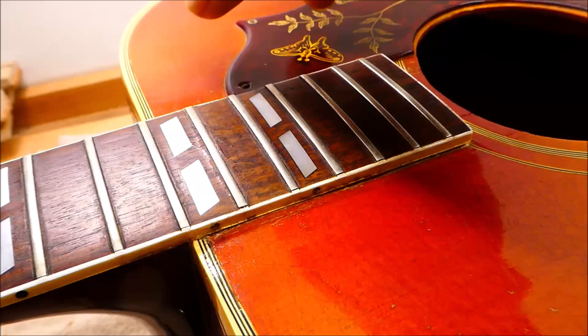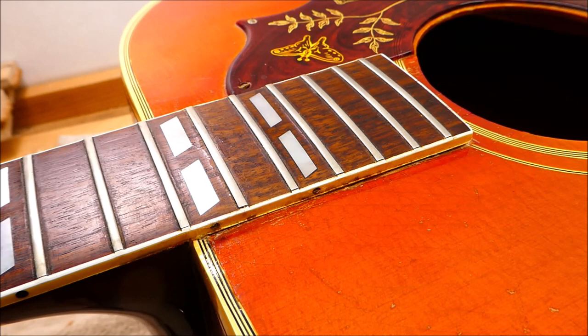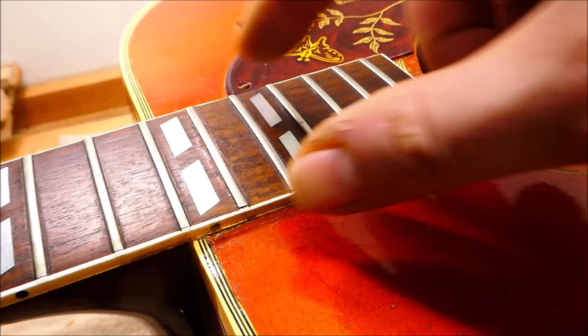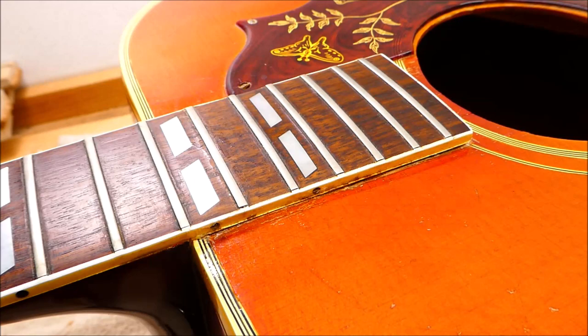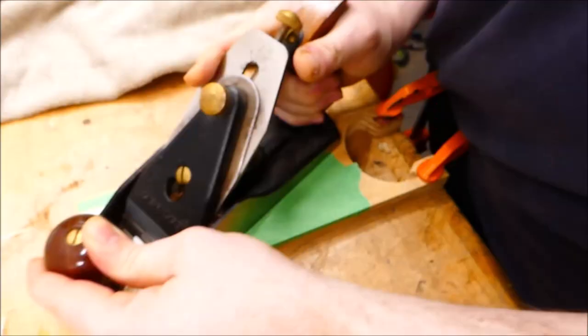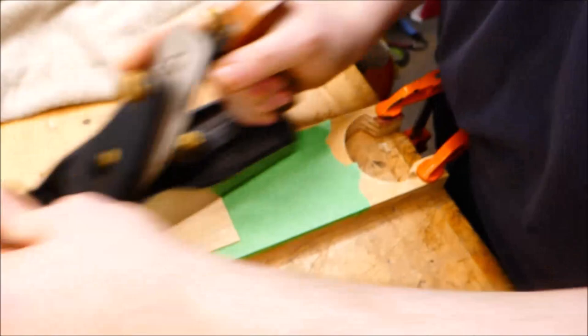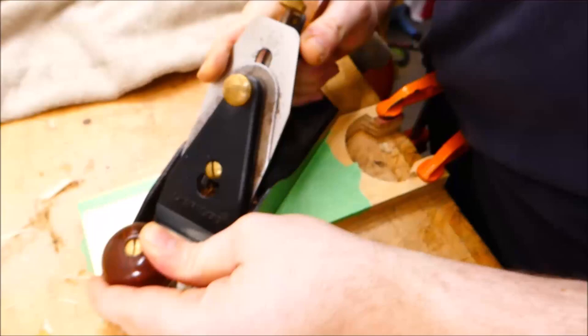I'm pretty sure looking at the inside that there is at least one open seam down the center, nicely supported by the big transverse brace, but it can be a wavy, undulating surface to fit to. Keeping the top surface of the fingerboard relatively level is important — this surface area is what's really preventing the neck from sliding forward toward the sound hole, which is pretty much the main goal of string tension; it wants to fold the guitar up on itself. Without a good glue joint here on a flat-top guitar, that becomes a real issue. I've used masking tape and super glue to affix the holly to a plywood riser; this lets me plane an angle that diminishes to zero at the far end.